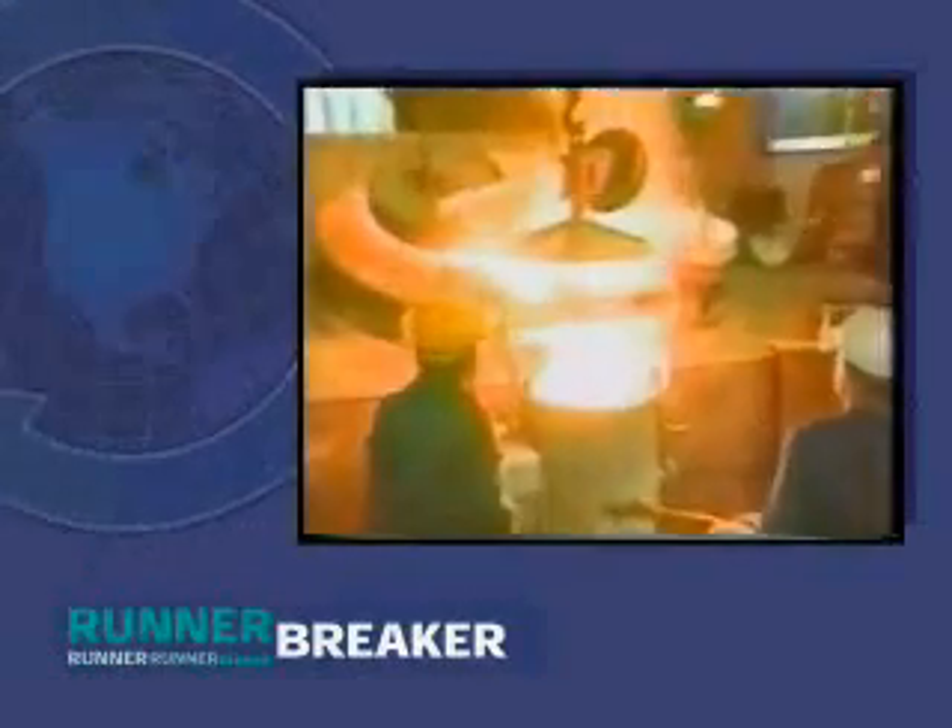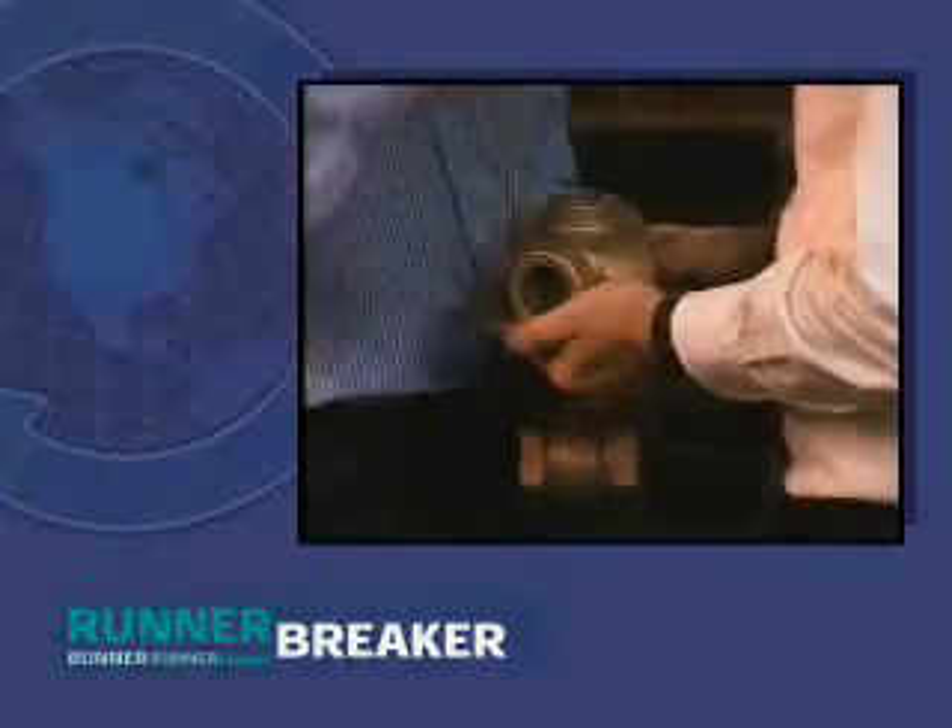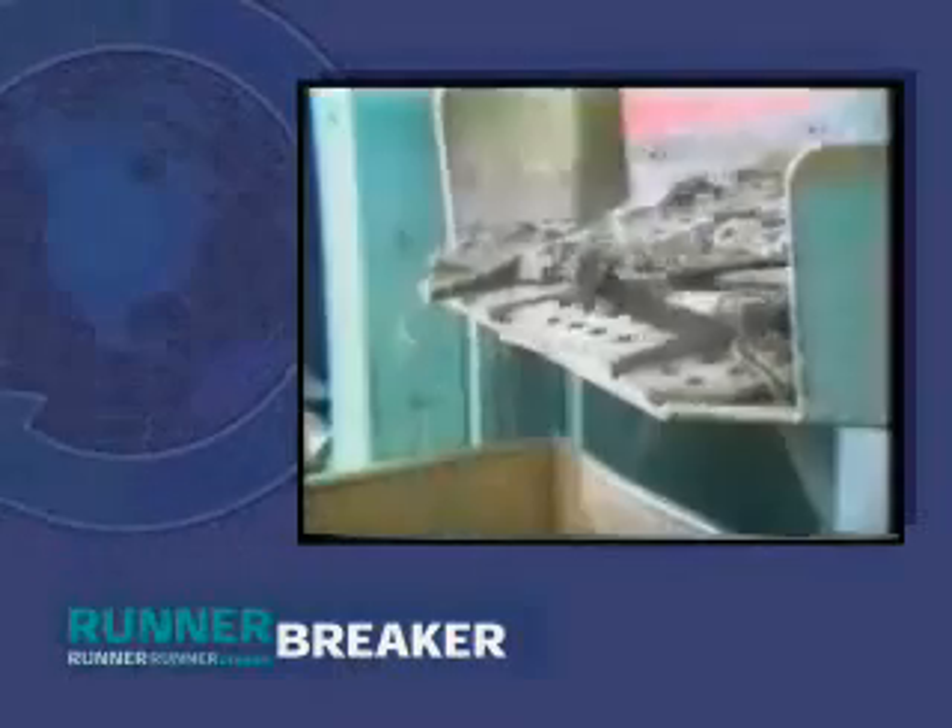The Runner Breaker, with its patented hydraulic crushing mechanism and high-performance blades, is designed to break down ductile iron, gray iron, brass, and aluminum runners and scrap, even sand and concrete blocks. The Runner Breaker turns large pieces of metal scrap into small, manageable sizes that will easily fit into a foundry's existing conveyors or buckets, or can be easily charged into cupolas and induction furnaces, melted down, and reused for future castings. The most unwieldy large metal runner shapes can be quickly crushed into small, uniform sizes that can be easily handled and placed on material handling lines for recycling.